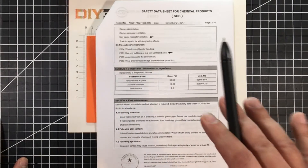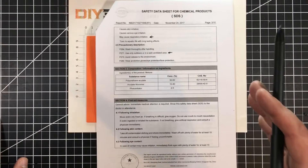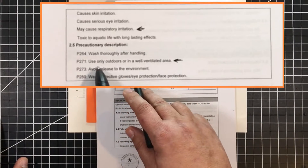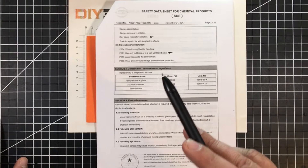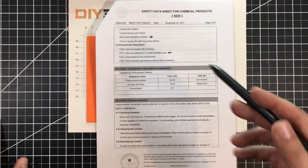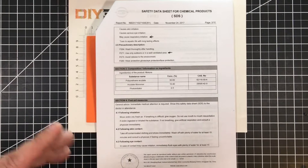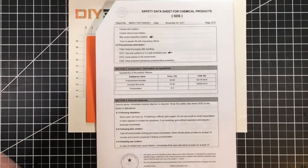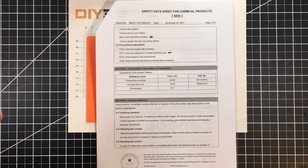One thing I want to qualify: we're talking about this in its liquid state, not when it becomes a solid — that's an important distinction. The precautionary description says use only outdoors or in well-ventilated areas. Please do not put this in your kid's bedroom or your living room. I don't even recommend your basement because it's still in the air envelope of your house. I did not have any SLA printers for about two years because I could not adequately vent them. I've since built a whole new shop where I have basically the equivalent of a fume hood to evacuate fumes outside.